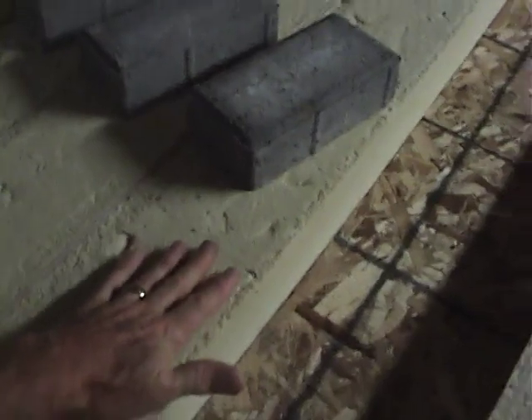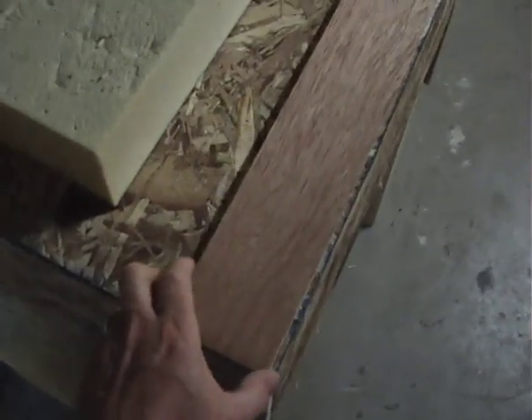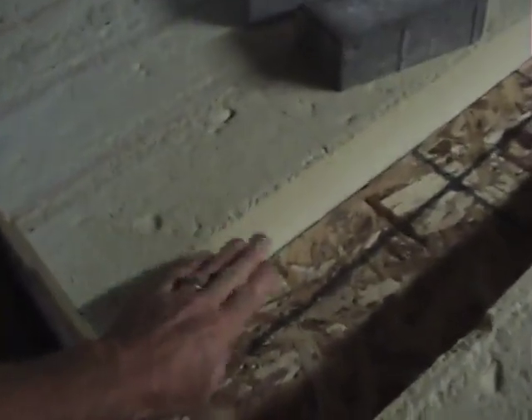The foam is also resting on small thin pieces of plywood between every section — plywood strips that are basically three inches wide by eight feet long, about five millimeters thick, the same plywood I've been using in the roof and floor structure, except only three inches wide this time. The foam is laying flat, so these three-inch walls are the walls that are going to be resting on the pontoons.